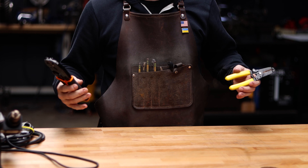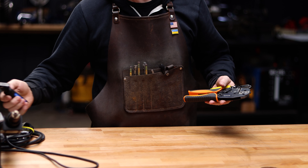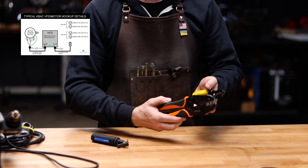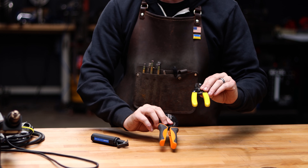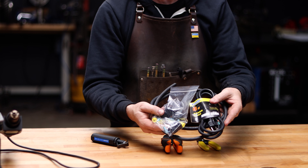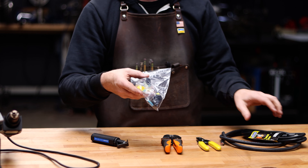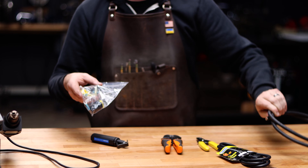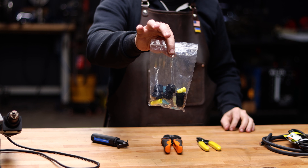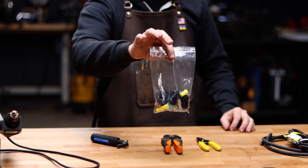Let's go ahead and just dive right into this build. I want to show off the work I've done over the last couple of months and see if this VFD will control the Revolution. Let's take a look at some of the things we're going to need. I'm not going to go in depth on the actual wiring — I've done this in other videos — but you'll see the wiring diagram and time lapse. You're going to need different types of wiring crimpers, some wire strippers. I sell on my website a 110 wiring kit — there's a 220 kit as well — but for this instance we're going to use a 110 wiring kit. It's got basically all the stuff you need, from the SJOOW wire, the six-foot-long standard 110 whip, and all the little glands, twist caps, and crimp-on connectors that will work with this VFD.